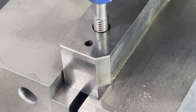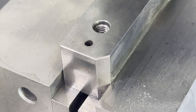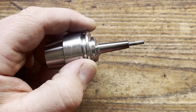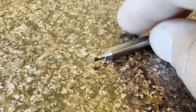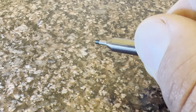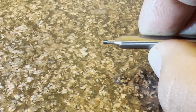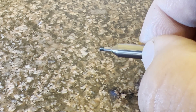Moving on to the milling — first thing I try to do if I'm milling carbide is: can I grind it with a grinding pen in the mill? I like that if I'm using a long length of engagement. The other option I look at is solid PCD. These are probably the state of the art in terms of milling carbide — they have 15 flutes, so even the small feed per tooth that these cutters run at, with 15 flutes, can be quite efficient. But these are also the most premium cost option.